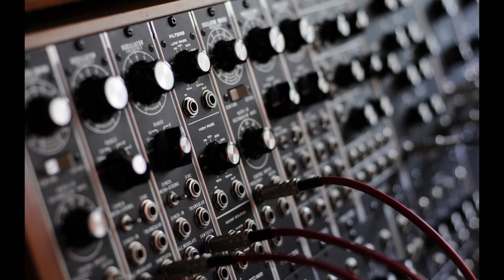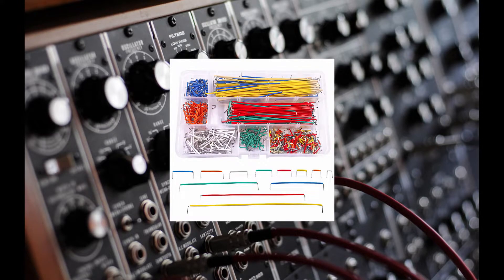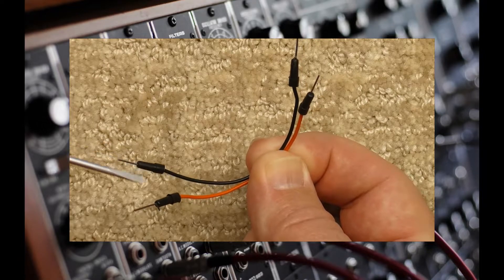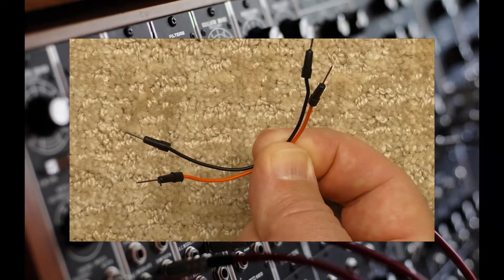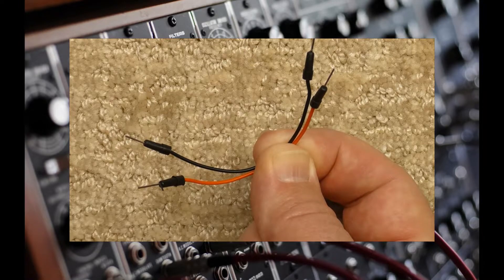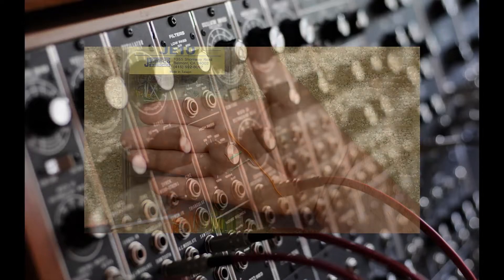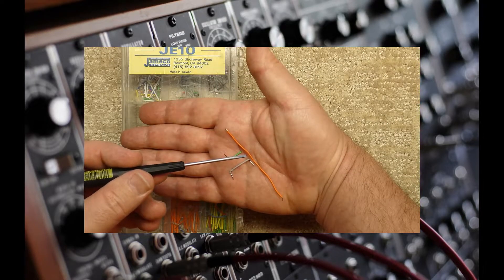And of course you'll need some jumper wires as well. I would avoid using the cheap round rubberized ended jumpers. I have had many issues with them and found them to be very unreliable when they suddenly stopped conducting on either end. Use straight solid wires whenever you possibly can.